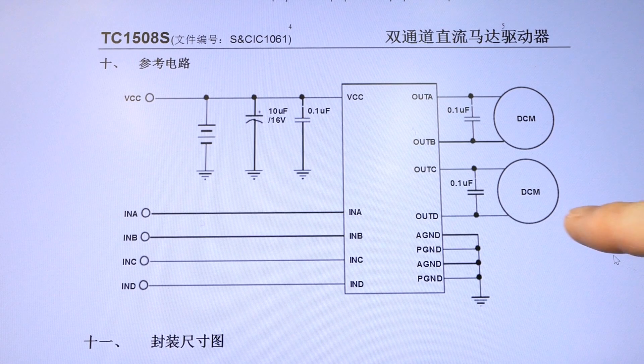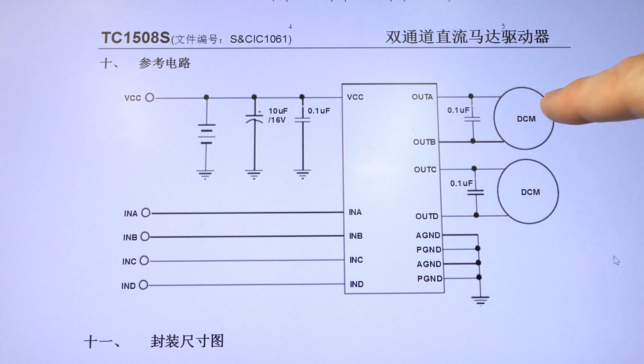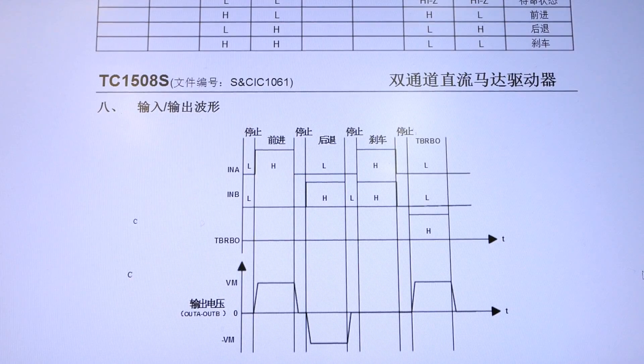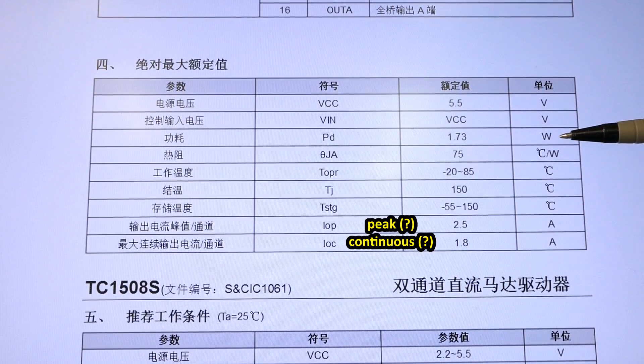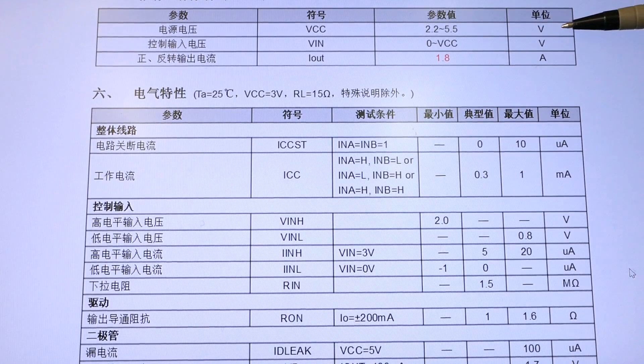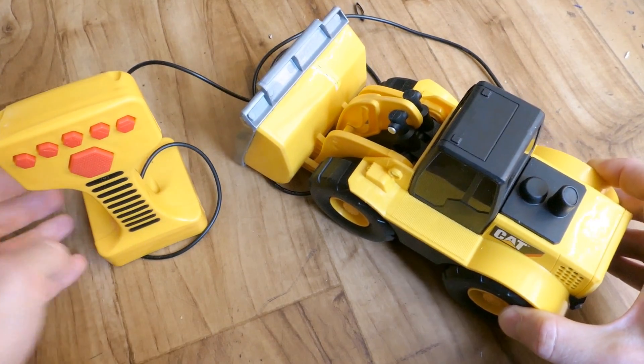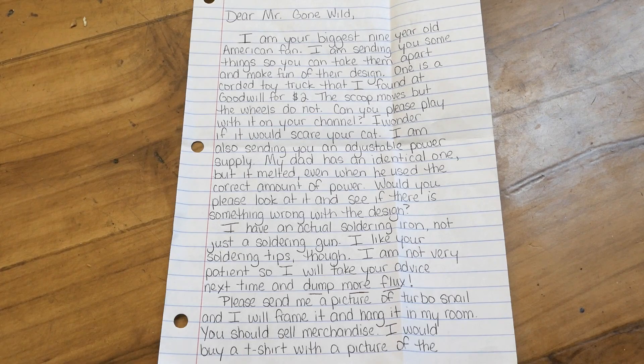The chip in it seems to be a dedicated motor driver for two DC motors — it has inputs to control it and power outputs to drive the motors. The datasheet shows how motor voltage depends on input voltages, the pin out, maximum input voltage, maximum power dissipation, temperatures, maximum current, recommended voltage range, standby current, voltage thresholds of the input — which seem like TTL levels — and the on-state resistance of the built-in transistors switching the outputs. So it's a very nice excavator, even though some parts are poorly designed or cheapened out — but what do you expect for two dollars?